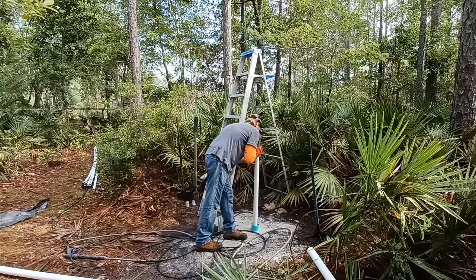So now we're going to fire up that mud pump and really push this water out of the way. Get this down another 20 feet. Then we'll insert that well point down inside that shaft. So once we sink this 1-inch pipe all the way down another 20 feet, so that's 40 feet down, then we'll insert the well point, if you can see the end of it. The well point will go into this shaft, pull this pipe out, quickly insert this before it caves in, and continue to plumb it up. I'd like to be down there about 30, 35 feet.